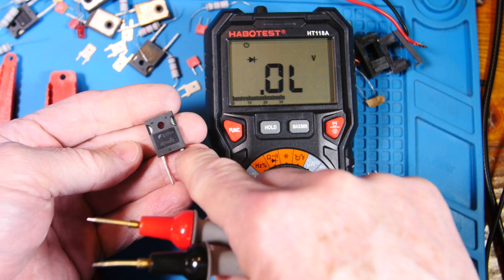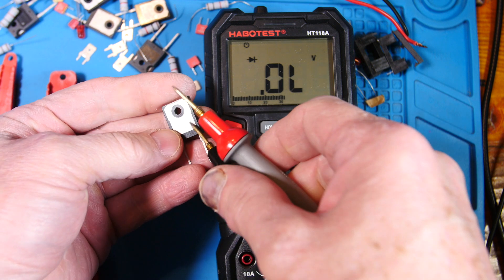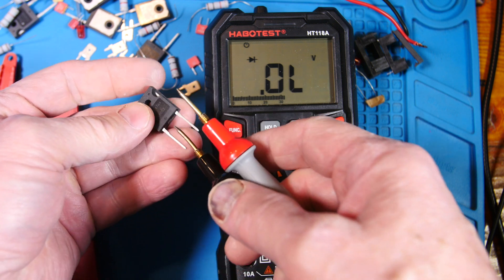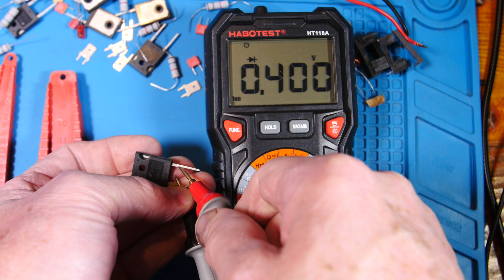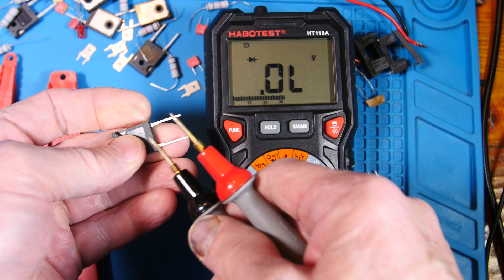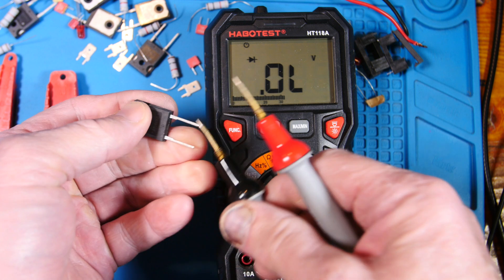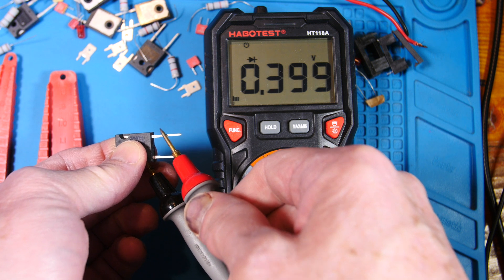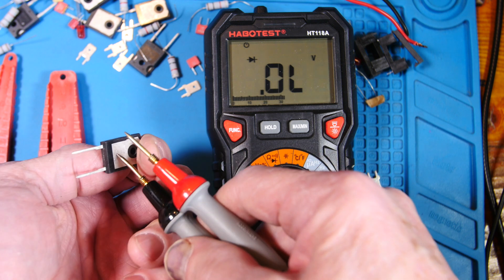Another consideration is understanding what the metal tab on the diode is tied to. If you were going to mount it on a heat sink you'd need an insulator. Measuring with a meter: we get a 0.4V drop on one orientation and open on the other, so the positive lead is the anode and the other is the cathode. On the back side I get the same connection, and then right here it's a short — so the cathode is tied to the metal tab.